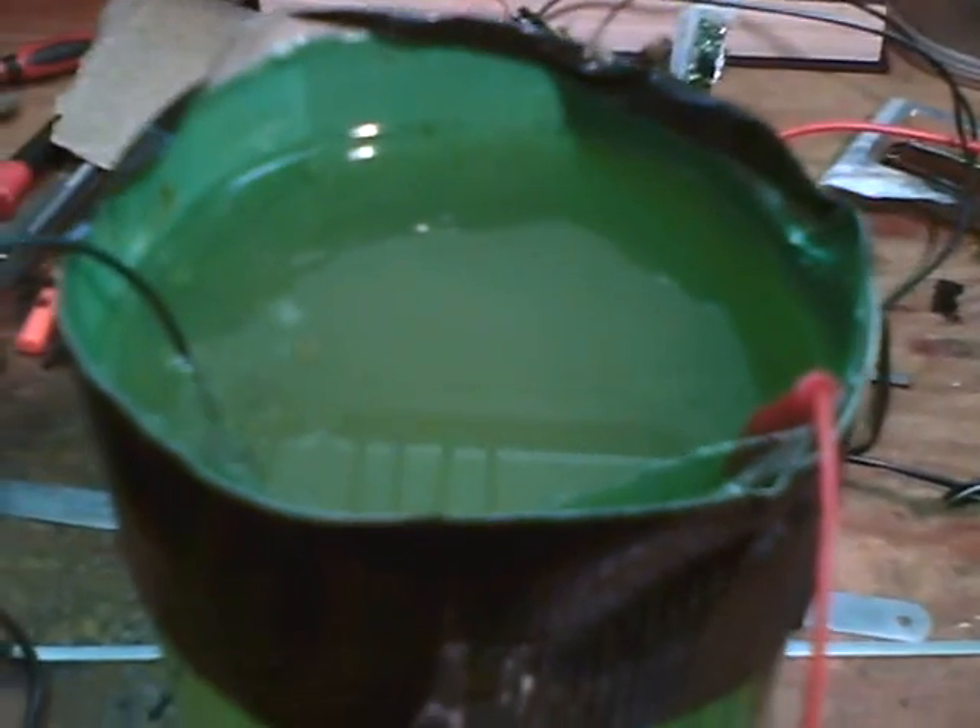I've got a little bit of glare in the water, but I'll pull this up so you can see. Those bubbles are hydrogen and oxygen, so you don't want those two pieces of metal to touch, and you don't want any sparks — not that it could explode, but... Right now I'm running about 3 amps through this. It will basically cut through the metal in about 10 to 20 minutes.